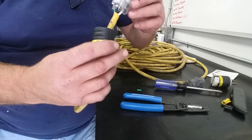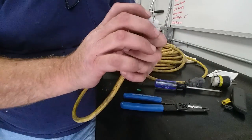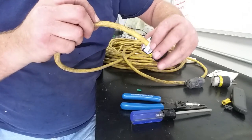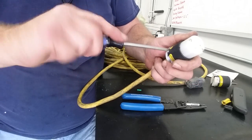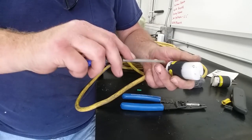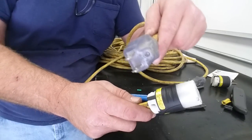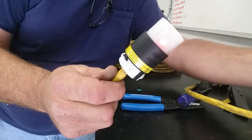Now it's time to clock our strain relief. They've got a little tattletale indicator on there. These are kind of a speed-auger style — they've got a real coarsely wound thread so they tighten down quick. On the back side you want to center up your strain relief and tighten that up. That's the female side done. We've got a good bite on there — no worries about that getting yanked out of our connections. But remember, we've still got a bad ground at the male end, so let's take a look at that red light — I'm just going to plug this in right over here. And there's your red light.